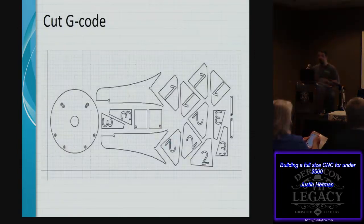The next step in the build is for you to go ahead and cut with G-code. If you're not familiar with CNC work, G-code is the instructions that are passed to usually the CNC that tells it the positions to meet at what particular times, at what particular speeds, and work the operations. So part of this design, you're building a brand new sled, you're building nice arms, you're building gussets for the rear mounts for the back of it. And of course, you can adjust any of these as you see fit.